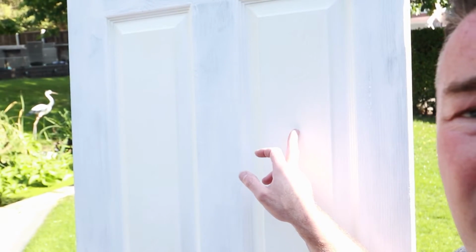It's translucent, not transparent, translucent. Opaque could be more solid, but I can see through it. The black I can see through. Now, looking at my Benjamin Moore below, that's had two coats. If you look really close, you'd probably say you want that third coat, which is what I said earlier. Being really anal, you'd give it a third because you were going over the black. But over the cream, that's covered for two. That hasn't covered very well for one. And the black's not good at all.